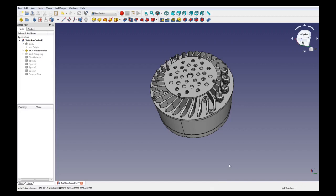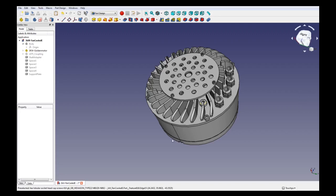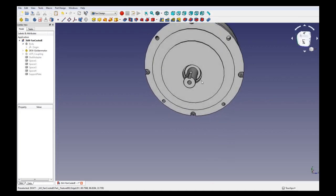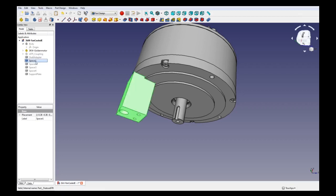Now we're looking at the 3D CAD model. What you see is the Golden Motor — the three kilowatt motor. You can see the wire outputs here and a bit of cooling. There's a fan on the inside, and the actual motor is on the big part. On this side you have the output motor shaft with a little keyway, and also the four support holes we're going to use to attach the spacers. The spacers look like this, and there are four of them.